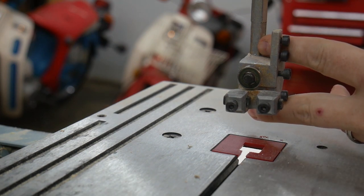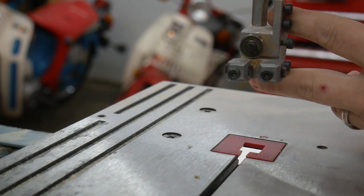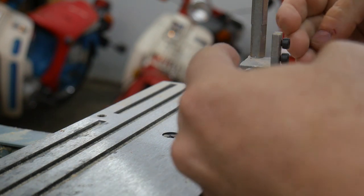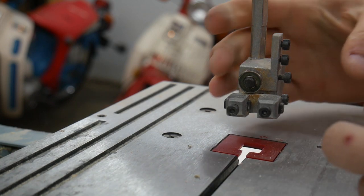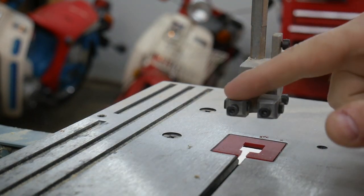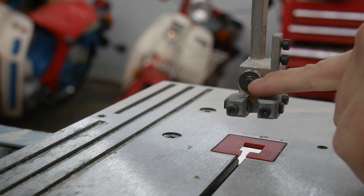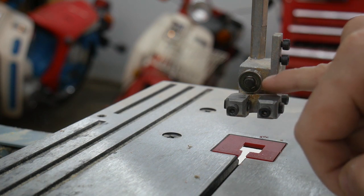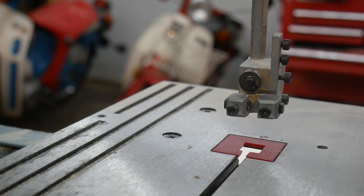Because what happens is when it's loose, I'm not really seeing it right now, so we'll see what happens when the blade's in it, but it feels like the whole assembly shifts to the right when I lock it down with the lock nut. It's almost like it's twisting it. And so it pushes the blade really close to this guide, which also pushes it towards the center post of the drive bearing. And there's evidence that the blade is riding on the post instead of on the bearing, because there's a lot of wear on the post and a little C-clip that holds the bearing in place. And I will zoom in and maybe get you a better look at that.